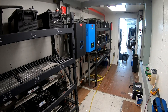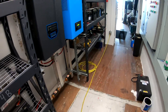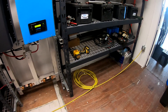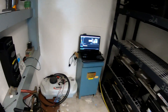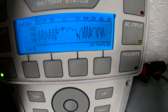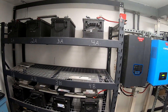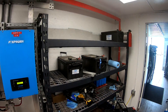What's up YouTube, High Tech Lab here bringing you a video today in this off-grid room. We're getting prepared to take down this rack because we'll have the lithium iron phosphate prismatic cells coming in a few weeks. The batteries aren't happy — each one of those peaks on the graph is the generator starting, so we're definitely not getting the capacity we should out of these cells. We're going to do a general balance and clean-up today.